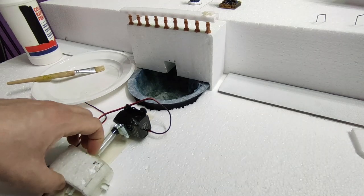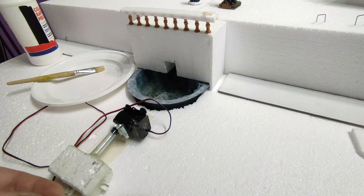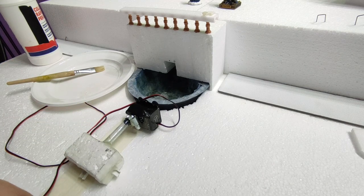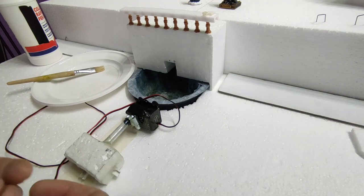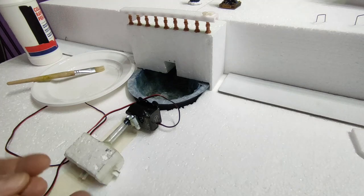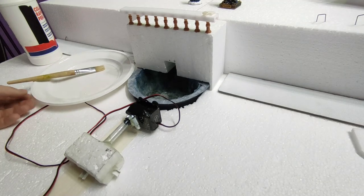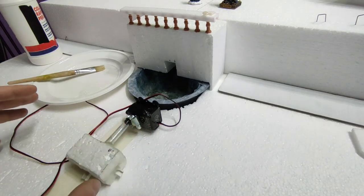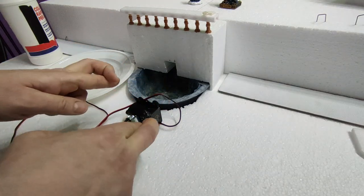It's always the case with some epoxy like this, where when you squeeze it from a tube, you don't always get the exact same amount of component A and component B, so sometimes you get more time to cure, to get very hard. I should have used component A and component B from separate containers and then mixed them together in order to have the exact same amount. Anyway, now it's done. I still don't know if it works, but let's get risky there. Let's suppose that it works. Cross fingers, guys.